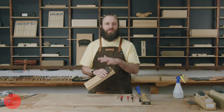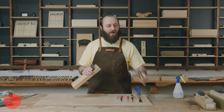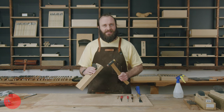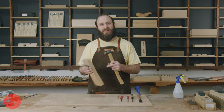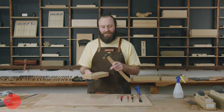So how tight do we want this blade to be? A good rule of thumb is that with five firm taps — and they are firm taps — we can get that blade to seat. We want those taps to be firm because if they're too loose and the block moves, we don't have much tolerance and we suddenly have a very loose blade that pokes too far out the mouth, and then we need to remedy that in a different way.